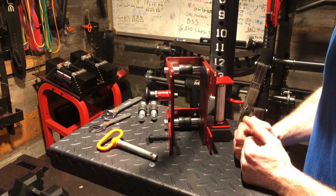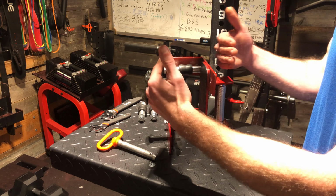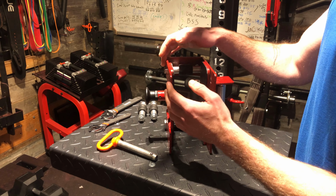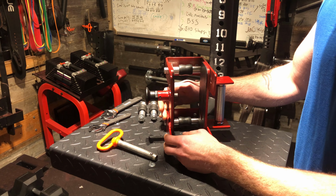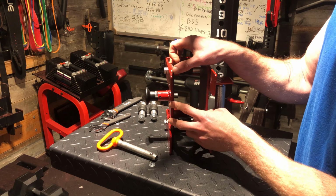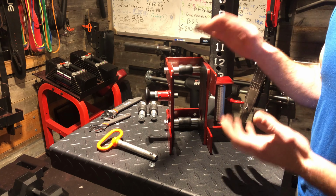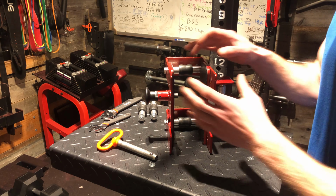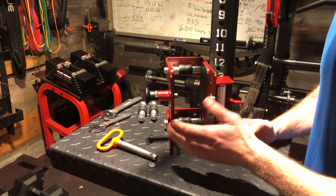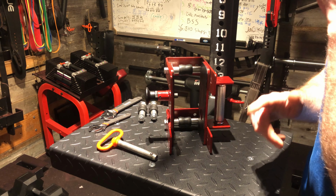So first of all, the first step I took was to make the side brackets. The side brackets consist of a piece of metal right here, 1/4 inch mild steel, 1/4 inch mild steel here, and then a little bit thicker piece of metal in the middle here. Not because you necessarily need that, but because that's just what I had laying around. I had all these spare parts from Rogue. This metal here, I got from Home Depot. One piece of it that I use on the whole thing cost me $30. I will link exactly what I used in the description too.